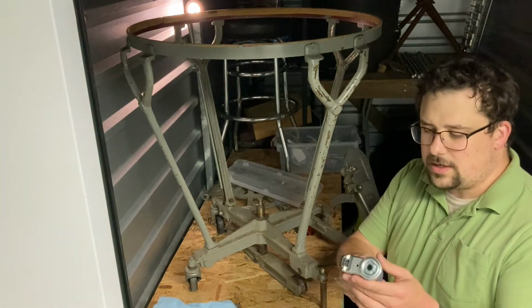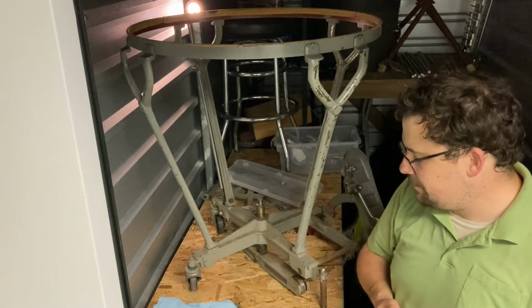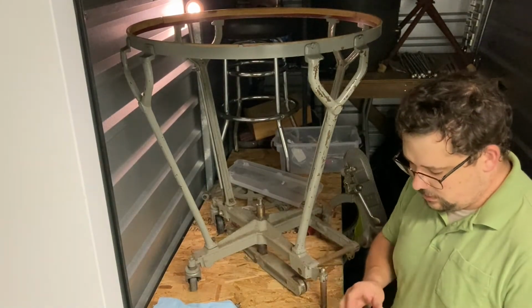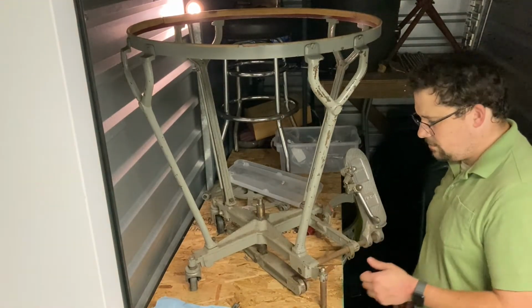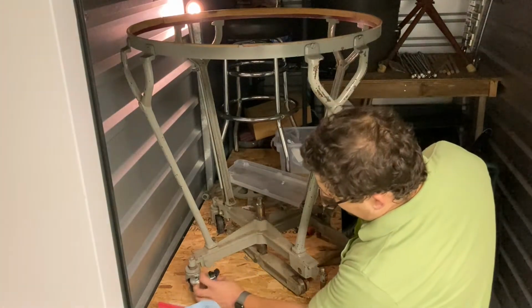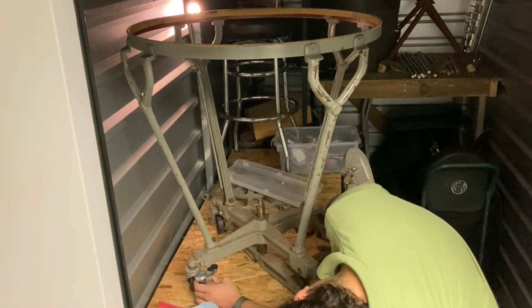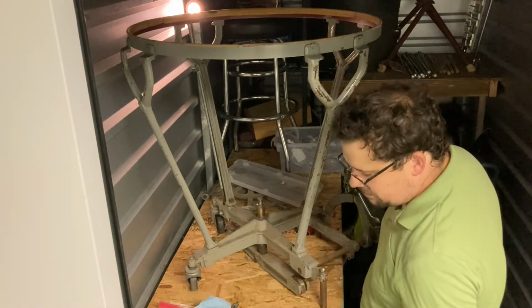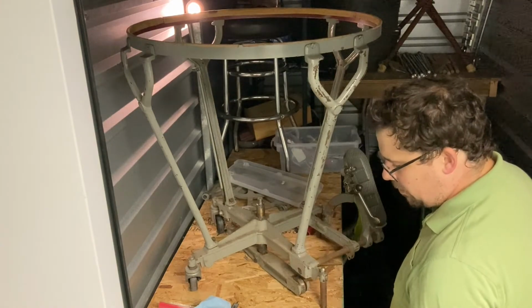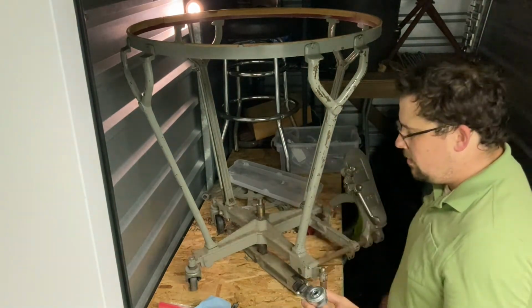But to get all these locking casters on, I'm probably going to need to put some tilters on the outside. Less for tilting and more for leveling. Likely going to need at least a 1 inch, maybe a 1.5 inch spacer. I don't think a larger wheel would have done anything. It just needs space between here and the casting.